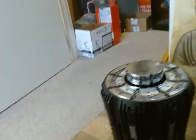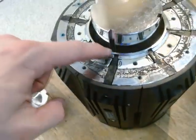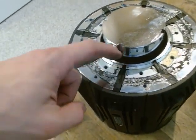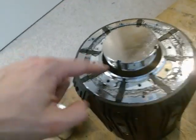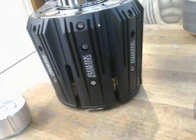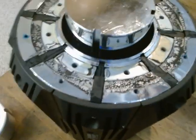Then we come over to V6, which we all know and love — the newest version. I've taken one apart here just to show you. You can see right here the gap ring actually has little cuts in it for these aluminum pieces that make direct contact with this internal gap to suck the heat out to this outside shorting ring and get it away from the neo magnet. So we have: distribution ring, neo magnet, steel sleeve, then aluminum heatsink. The bottom part on the V6 looks just like this except instead of these holes it has slits to match the outside of the motor, so we have active cooling of the inside and outside aluminum by this high-velocity air coming out of these slits, pulling it straight out of the gap.